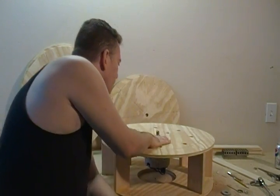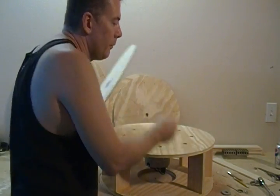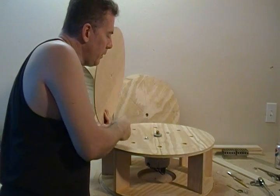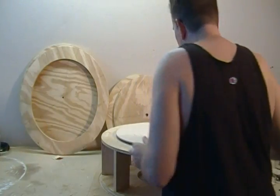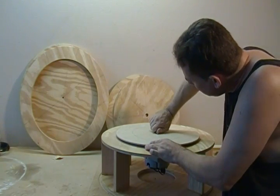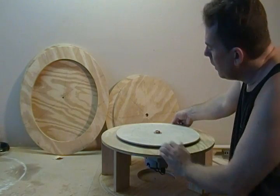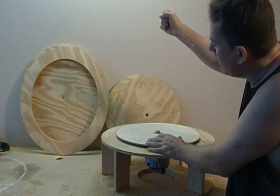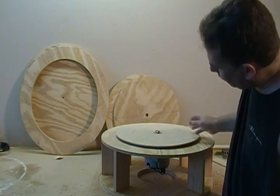Right now what we want to do is mount whatever you're using and put our bottom rotor in place here. You have a couple of 5/8 inch galvanized washers to space this up above the nut so it doesn't rub. Just put it on finger tight and make sure everything's good to go. It may feel a little flimsy at first, but once the whole rotor is built it's going to be secured at the top and it's quite rigid. So we want to check that and check our hardware for fit.